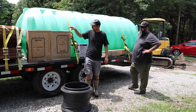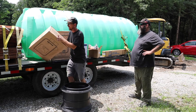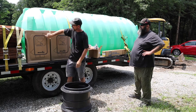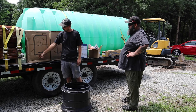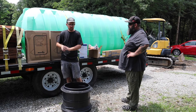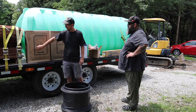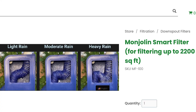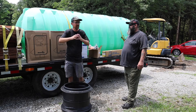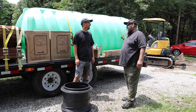We have pre-filters for your cistern. This is a downspout debris filter — the downspout connects to the top and there are two clean water ports that carry water to your cistern. There's a flexible filter tube inside that makes a kind of trap. It opens up the filter screen as the weight of water comes down and filters to a 70-micron level, which is as fine as you can get for pre-filtration.